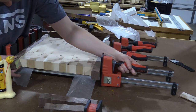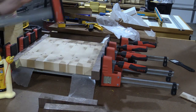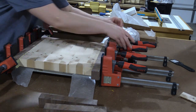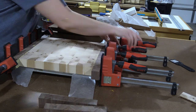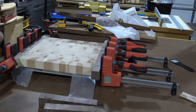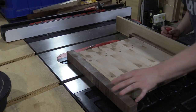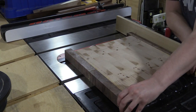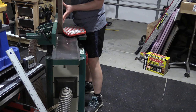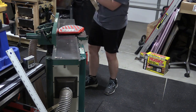There are a couple of reasons why the walnut is going on in two parts. I was using scraps, so I had longer pieces and didn't need to make a wide walnut board from scratch. If I'd made the full 16 and a half inch width of walnut I wouldn't have been able to use my planer. It's a nice tight seam and you'd never know the difference. Next I trimmed all four edges to get a nice flat surface for the other border and jointed the edge for a tight fit.